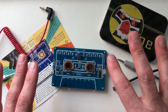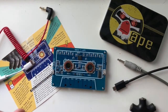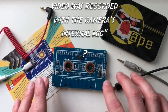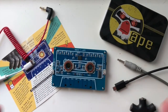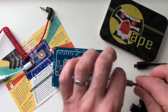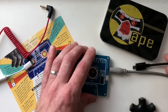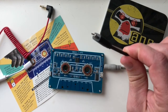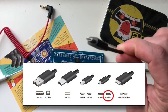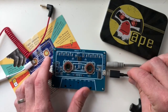Here's our Mixtape — let's do a little demo. Real quick, the output cable is going into the monitors on either side of the camera, so you'll hear my voice and the sound coming out of the monitors. For cables, you need an eighth-inch mono — not a stereo headphone jack — for the audio, going in right here. Then you need a USB cable for power. This is a micro USB Type-B cable, and that's the one you need for this interface. Let's plug that in and we hear noises.